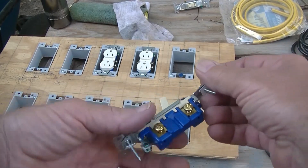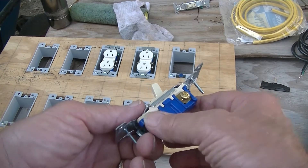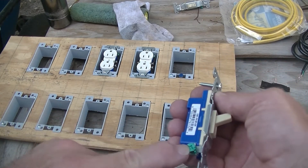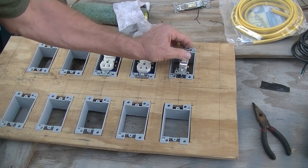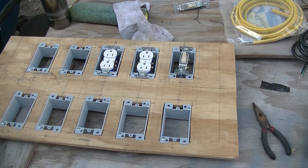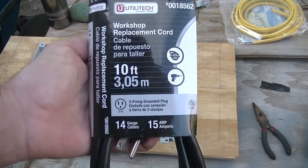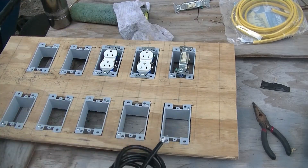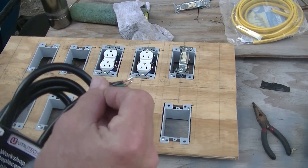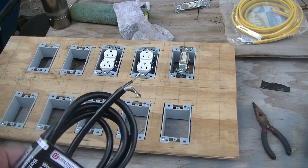So now here's a switch. You see it's brass and brass — that's the black wire. You always run the black wire to your on/off switch, and the ground. So that's going to go here. I've got this cord, 14 gauge. This is going to power the whole thing — both these switches. It's going to splice off this black to both switches. I'll do that later.